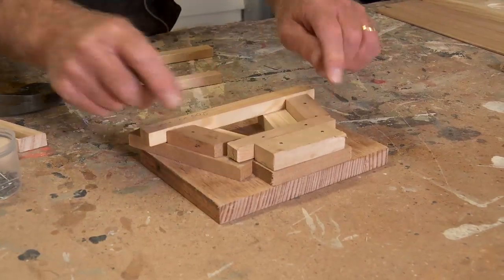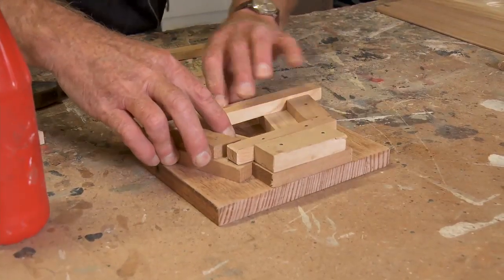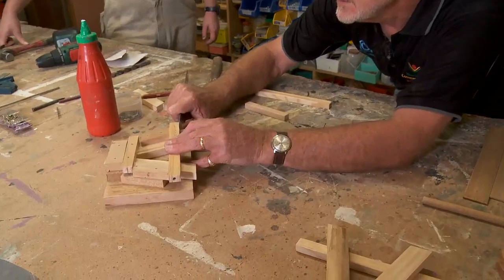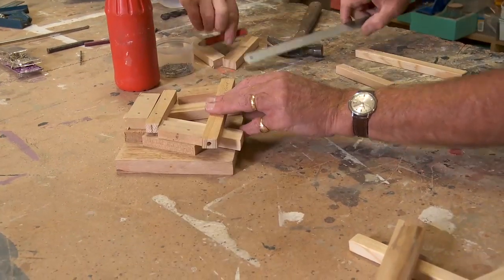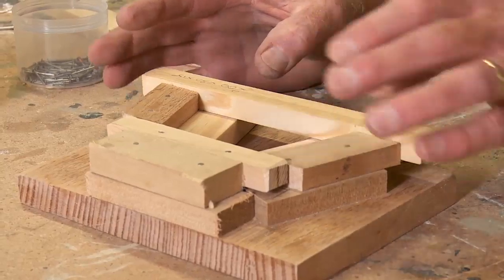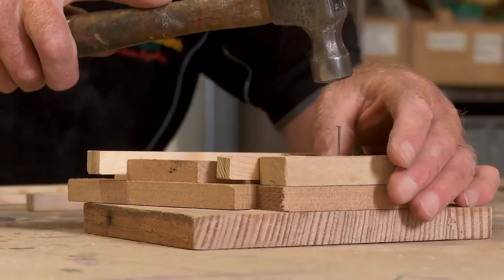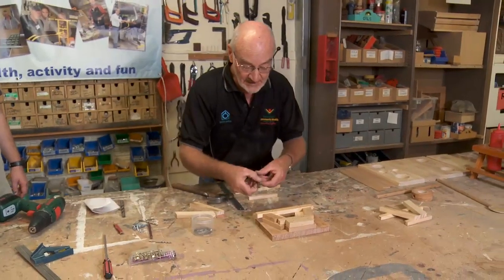If I put two nails in the top there to start with, I wouldn't have any movement here. So I want to keep those like so — we've just got to make sure we put this in the right position in that direction. I'm just going to measure — it's about 33, not far out, I reckon that's pretty good. A top of woodworking glue again. Now that I've got all those in, I'm going to put a second brad in each joint, and just punch those in a little bit.